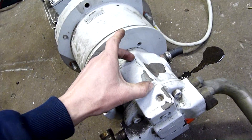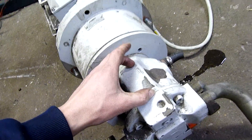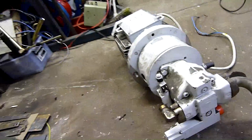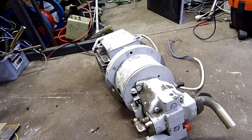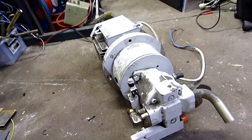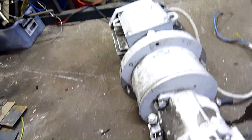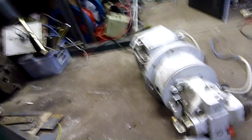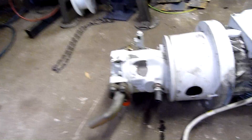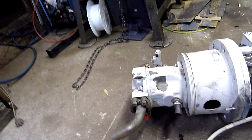It's all in here, and any bleed-through goes through the bearings, lubricates everything, and then goes back to tank at atmospheric pressure or near atmospheric pressure. You can't back that up for any real amount of pressure, otherwise you'll blow it out the main seal and into the pump bell housing. Always make sure that it can dump back to tank without any restriction, otherwise you will blow your main seal out.